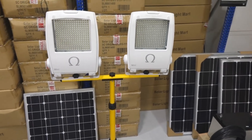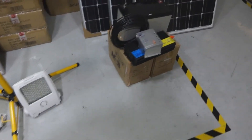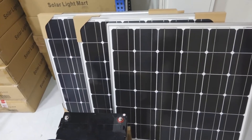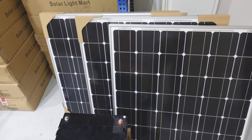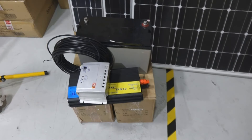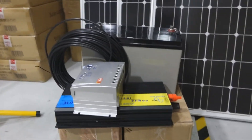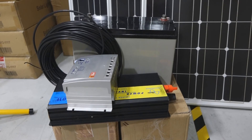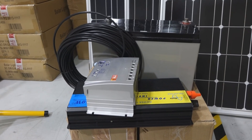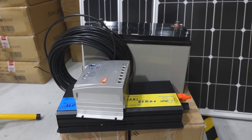Let's say if you have a very big billboard and you want to use this to light it up. In order to light it up, you probably need 3 pieces of 100W solar panels plus 3 pieces of 100AH batteries, as well as an MPPT controller and a bunch of 6mm square solar cable or low voltage cable.